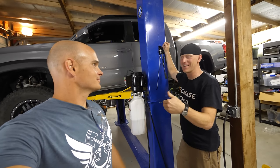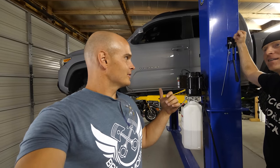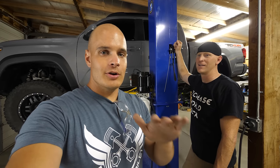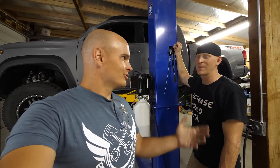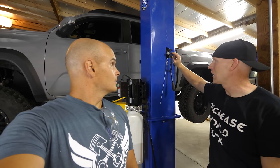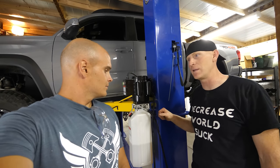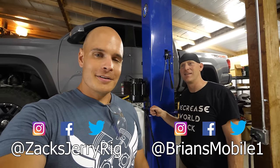Thanks to Brian — you can find his channel at Brian's Mobile One. It did take us about two days to install this lift. The thing that bugged me was the website said it could be installed on 4 inches of concrete, but that's the only place on the internet that would say such a thing — even the instructions said it needed to be over 4 inches, recommending around 6. We went with 8 inches to be super safe. All in all it worked pretty well. Everything went together well; we didn't have to do much welding or grinding. There was some minor stuff with the cable return and one thing bent in shipping, but in a project this size that's very few issues. Now we can start on some bigger projects!